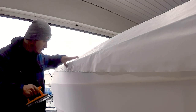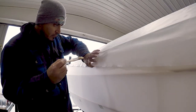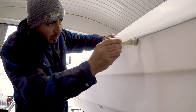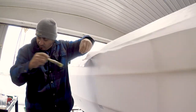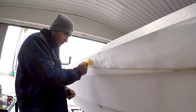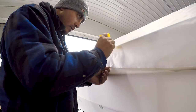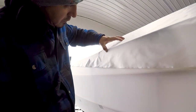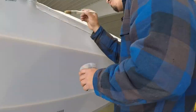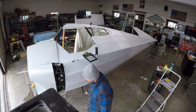I'll make relief cuts and then continue to glue all the way down the belly, trying to keep it as smooth as possible. Once you've got it there, draw the line, put a little bit of polytac on that line, take a razor blade and do the razor blade trick to trim it — a perfectly straight line with about one inch of material overlapping right on that belly section.